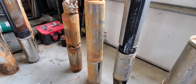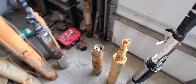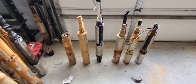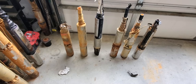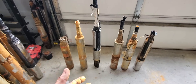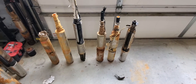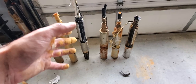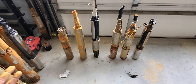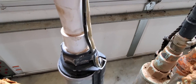A brand new pump can build 200 PSI, but eventually it wears down to 150, then 120, then to the point where it can't even satisfy the pressure switch. You go down and the gauge says 25 PSI and it won't build anymore. If you turn the breaker off and you're not using water anywhere, and the pressure gauge drops from 30 pounds all the way to zero with no spigots open — that means the water in the system went somewhere.